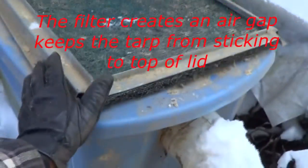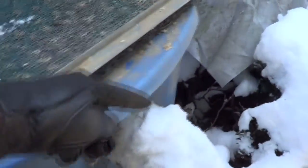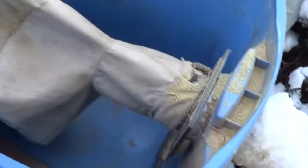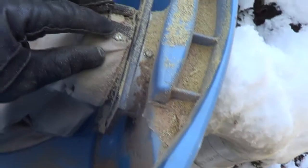I took off my tarp lid. This is something I found — I think it's an old furnace filter — and there are all my holes that let the air exit. I don't really know what it does, but it seems to catch some of the dust. When this thing's running, that tarp will actually parachute up — you can tell it's working because it raises up a few inches. Usually there's not too much dust coming out of here. I use a rope to tie down the tarp — this just keeps everything dry. This is the original bag that came with the dust collector, your regular microfiber bag. I had to get that bag mounted to something to connect to PVC, so I just used one of those cheap gates — it always stays open — just to give me a coupler. A quarter-inch self-tapper holds this bag in, and when this is running, the bag is fully inflated.